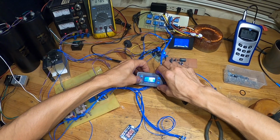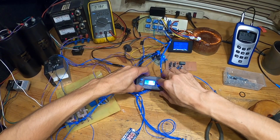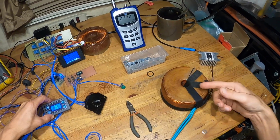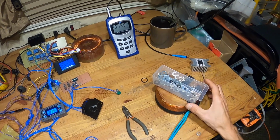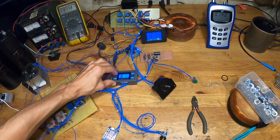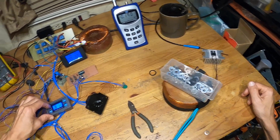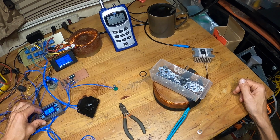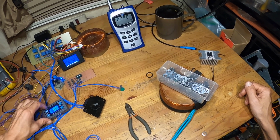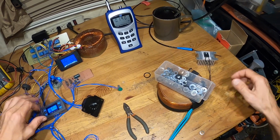and I will go ahead and lower it to 1 Hertz, and we'll set 1% duty with 1 Hertz. So every second it's gonna pulse once. So check this out. See, this is 1 Hertz. Now if I increase, this is 2 Hertz. This is 3 Hertz. This is 5 Hertz. Increase the power. 6, 7, 8, 9, 10, 11, 12. 12 Hertz.